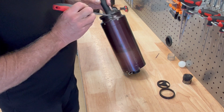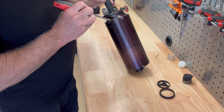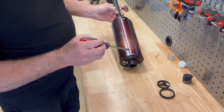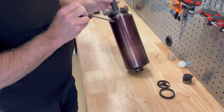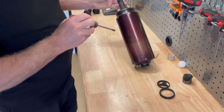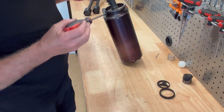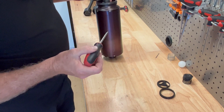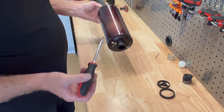You'll also notice some corrosion coming out the bottom of the pipe — there was a trail of corrosion running down the side, so it's actually leaking through there. When these pipes get hot, the two large square o-rings at either end melt, and then the exhaust gases or cooling water start to seep out of the pipe. That's what's happening here. You can even see the tube has started to go out of shape from the heat, so in this case we'll replace the complete unit.